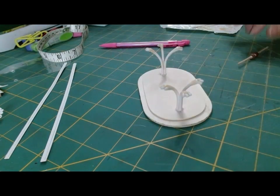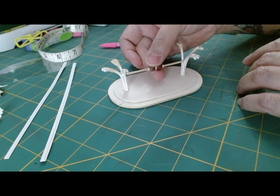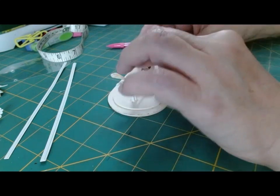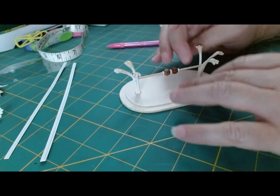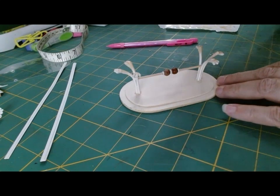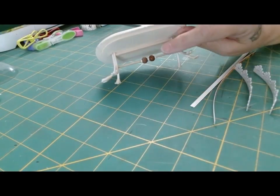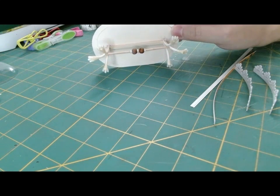Before adding the trimming, I needed to add a couple of support bars. I dipped the ends in glue and added glue right in the nooks where the bar would sit, pressing it nice and tight and making sure it sat straight and even between those legs. I added additional glue right on top of the bar in the nooks for more security. I also decided to add a second support bar glued to the table itself in between the legs, which helped make it nice and strong so it wouldn't be wobbly.